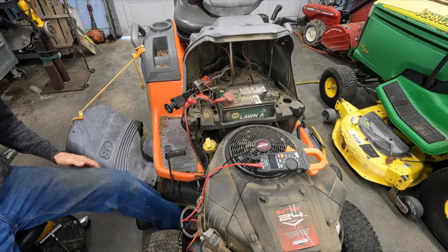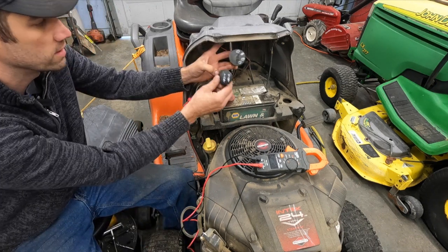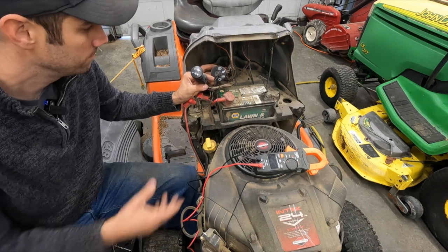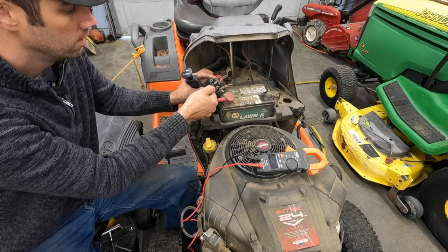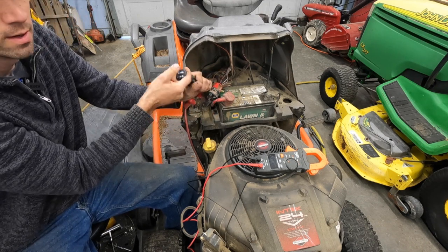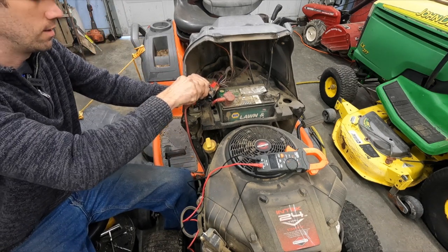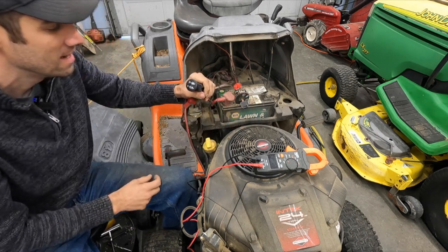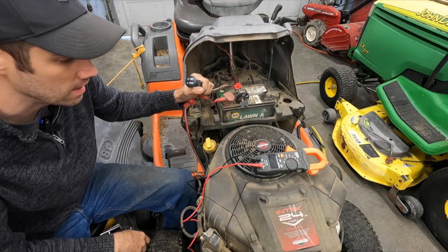For simplicity's sake, I have taken the hood off so you guys can get a better view. I've pulled the switches out and just put them in the back so you can see what we're doing. If you were to turn the key on and pull the PTO switch, you should hear the clicking underneath, and it's not. So the question is: do we have power getting to the PTO?